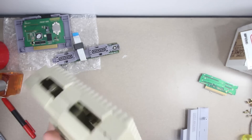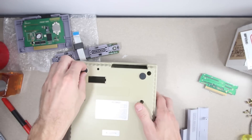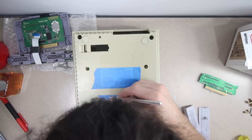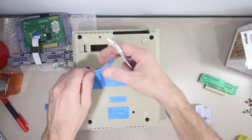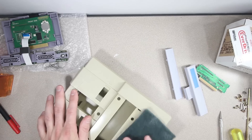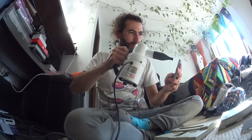Got to prep the surfaces quickly. Now the top part doesn't have anything to worry about, but the bottom has these stickers that I do want to protect and I want to save these feet. I'll trim around them with a sharp blade and use a ruler to make sure I get the straight parts nice and straight. Now that we've got everything masked off, the next thing we need to do to prepare the surface for paint is scuff it up with a scuff pad. Basically, if it's shiny, the paint won't stick. Now that the pieces are all scuffed up, the next thing to do is blow them off, because they're all covered in fine dust and you don't want that in your paint.